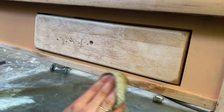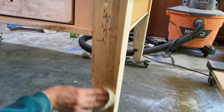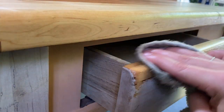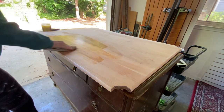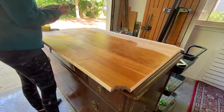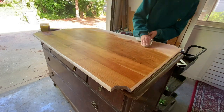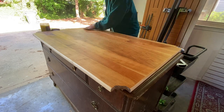The reason I'm using a wax finish opposed to polyurethane or something like that is because I prefer the more eco-friendly option. Melange is really good about that — not only are most of their products eco-friendly, but their containers are all glass, which means they're completely recyclable or reusable for storing screws, hardware, mixing paints, all that. I'd highly recommend looking into their products. Waxes protect like nobody's business — you do have to go back over them every couple of years to rebuff and add another protective layer, but I really love the finish and shine that wax gives.